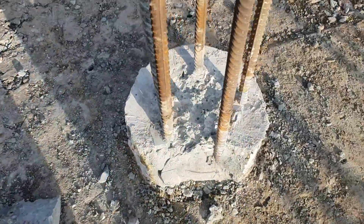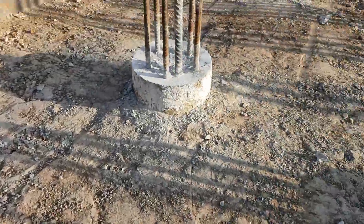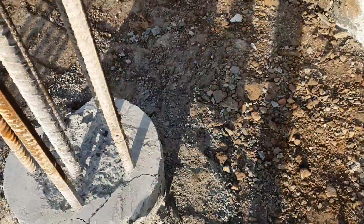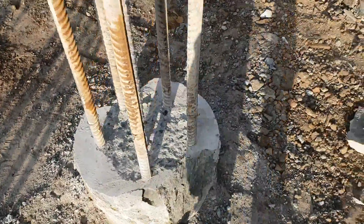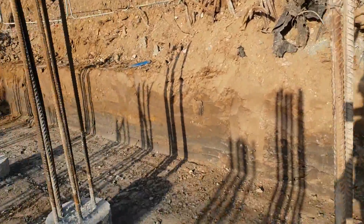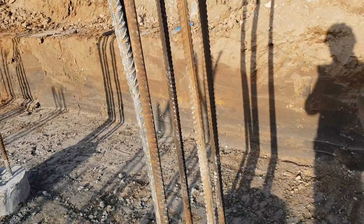This is a nice cut level. I want to show you one more thing — loose beads. All loose concrete beads like this have to go. It happens when you break the pile sometimes you get a loose bit, but it has to go. The structural concrete has to go around it, so it's not the end of the world if it's broken, but all loose beads have to be removed.